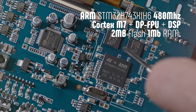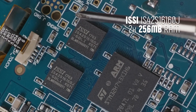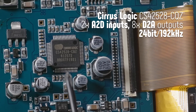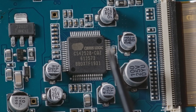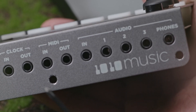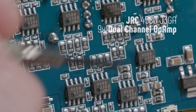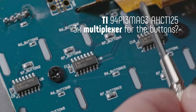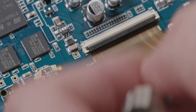So what do we have? We have the main processor over here, which is an ARM chip. Then we have two memory chips here and here. Then the most important chip — this is effectively the audio interface. The chip in the Black Box has one stereo input and four stereo outputs, which corresponds to the audio we have: one stereo audio in and four stereo audio out. Over here we have nine stereo op amps. Then we have those three chips over here, and the ribbon cable that connects the display and the encoders to the main board.